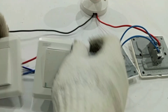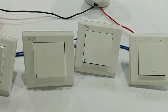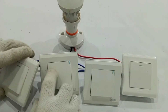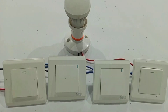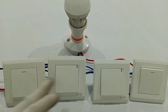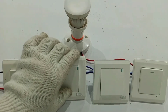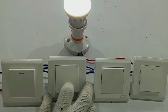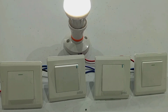Now we turn our switches on. Supply is switched on, and we have switch one, switch two, switch three, and switch four. The aim of this wiring is to enable us to control this lamp from any of these four switches. I can switch it on here, switch it off here, switch it on here, and switch it off here — any of these switches should be able to control the lamp at any time.